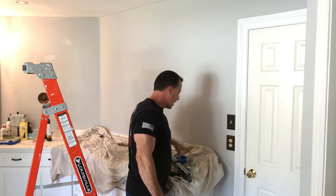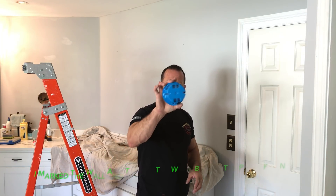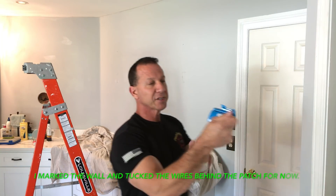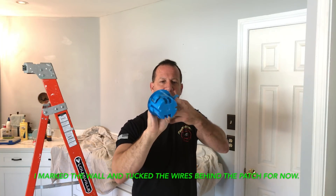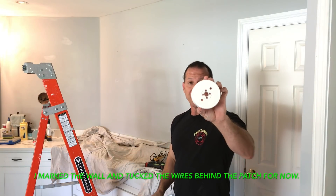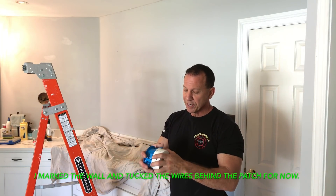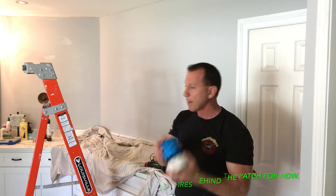I floated the wall out right there where I had some holes from the other fixture, and here is my pop-in box. This box has little paddles on the back so when you tighten these screws up it'll lock it from behind, and you make your hole a little bit smaller than this lip. This is a four-inch outside diameter hole saw, so it's going to put the perfect size hole for my pop-in box.